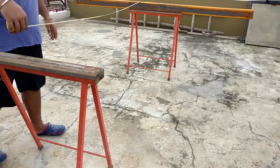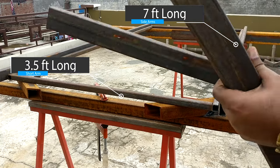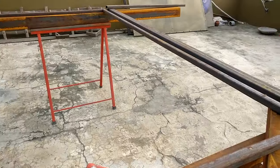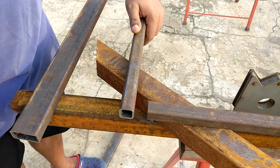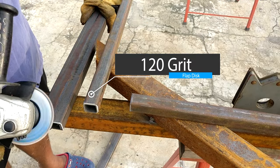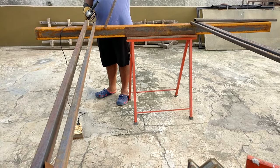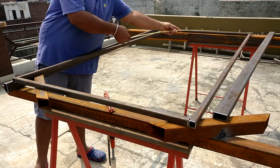The first thing I'm going to do is lay down my saw horses and place some pipe over them so that I have a wide area to work on. Since the wall thickness is sufficient, I decided to do the chamfer first so that it will make a nice connection with the other pipes. This process also removes the burrs from the pipe and allows them to align properly.